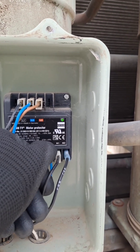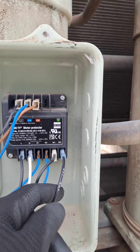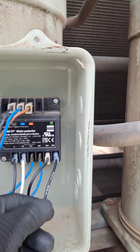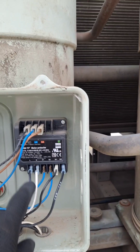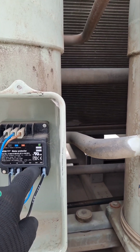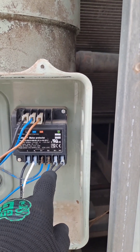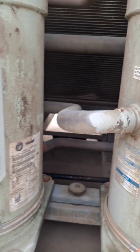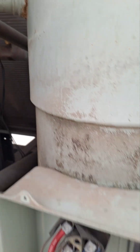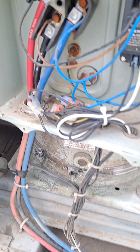On M1 you have 120 volts coming in, and if you have no safeties or trips you should have 120 coming out. One of them: 120 comes in, comes out — and the high pressure switch is right there, which is also in this circuit.